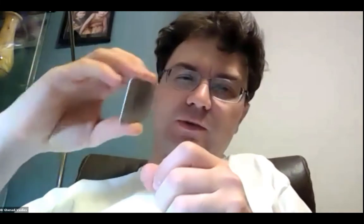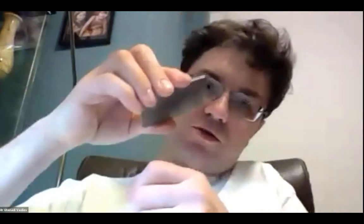When you take a card, it's also a little trick. It's kind of counterintuitive, but you have to learn. With one hand, you have to exert some strength to give stability to your tool, to your cutter. But with the other hand, you have to be somewhat relaxed. If you exert too much strength with a card on your cutting edge, that's when the problem comes, which Terry signified, that you may roll over the edge. So one hand, you apply strength. With the other hand, a little bit relaxed.